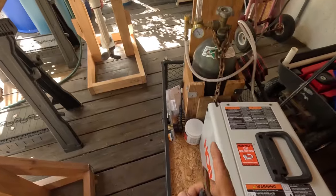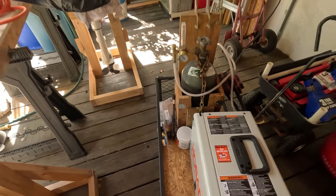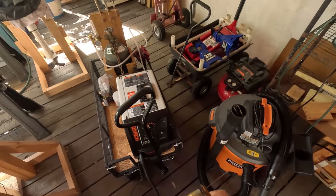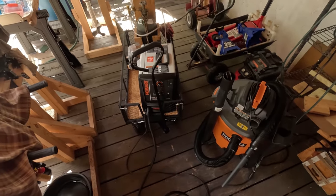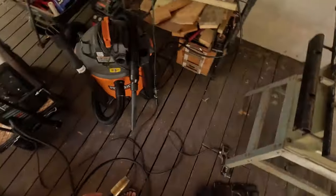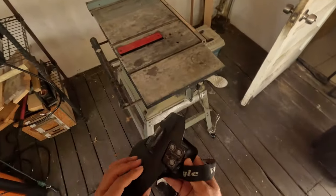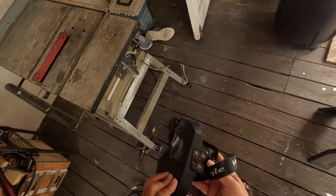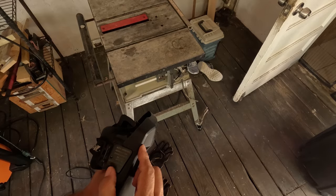All right, I'm gonna check my gas range there. Right between 15 and 20, that's good. Trim my wire. And gas is on, that's on, ground is on. So I think we're good to go. Take off my safety glasses. I'm gonna use these welding ones. I'm gonna go to on.